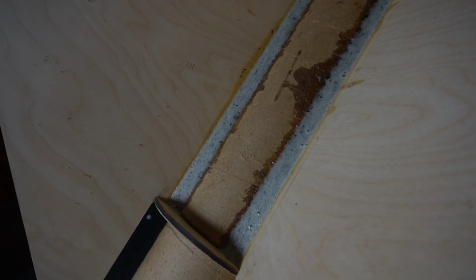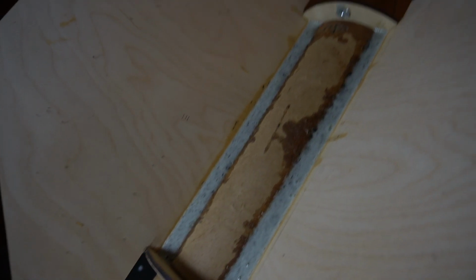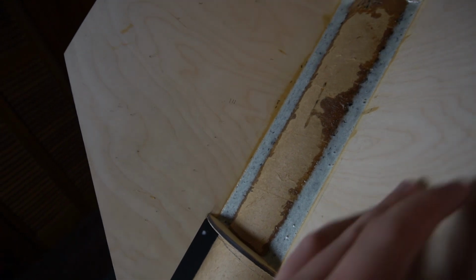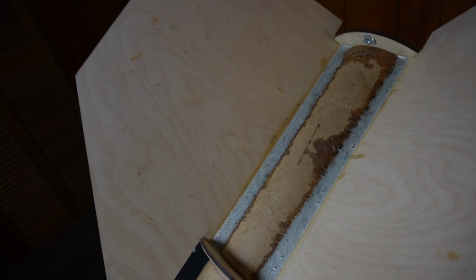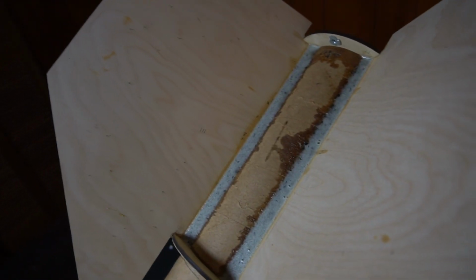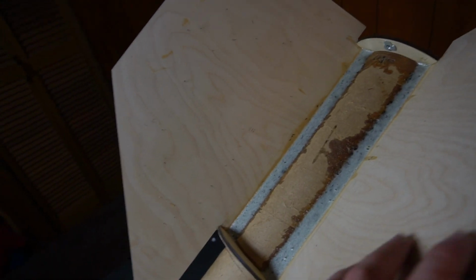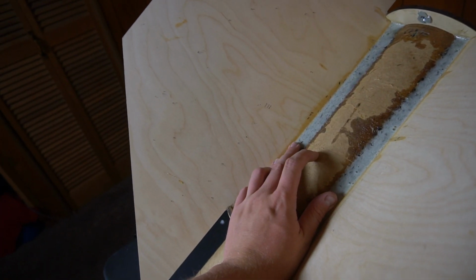I'll probably still use West Systems. I don't have any issues with rock epoxy. It's just not my jam. I like to lay my fillets and fix them afterwards, and rock epoxy is sandable. It's fine. I actually use it on my orange 3-inch Punisher. But I just like my West Systems with a bunch of filler. It's really easy to sand and get the shape I want. And that's just the way I do it.